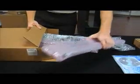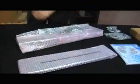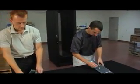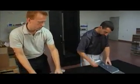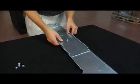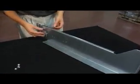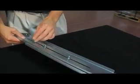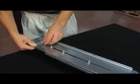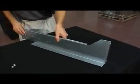Next, remove the rail mounting kit. You have a left and right front and a left and right back. Make sure you have all the brackets, screws, and clips you need. It's easier to lay them out before you start. Next, assemble the rails. At this point, just finger tighten the nuts. This way they'll move in the rack when you need them to. Then attach the rear hold-down brackets and finger tighten the nuts. Make sure the rail pieces move freely for easier installation.